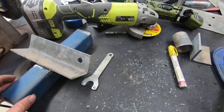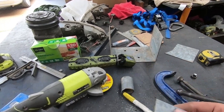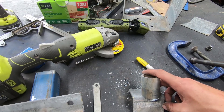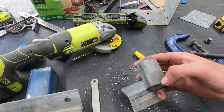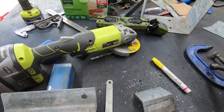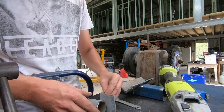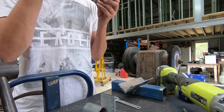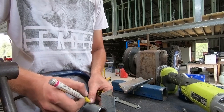The base piece is cleaned up and ready to weld. Now for the bending piece — the part that actually comes down to make the bend. I'm pretty sure if I just butt-weld the angle it'll eventually bend outward under press pressure, so I'm going to recess the angle into this piece too for structural rigidity. I'll measure how far I want to recess it — about 25mm — and mark it.